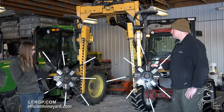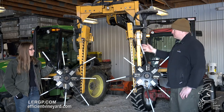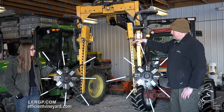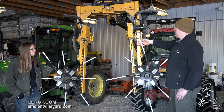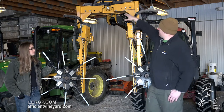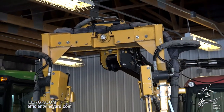So can you take us through the architecture of this machine, what it does and how it was designed? This machine here is a V-Mac tool arm with the Oxbow type head from when Oxbow was manufacturing and producing the tool arm and the heads. This is an offshoot of what was the Friday machine in Michigan and the Joy Laporte pruner here in New York. You have a comber style system with cutter bars behind — some have a top cutter, but most just have two vertical cutters. Also, the pruner has a pivot point; the head swivels side to side. So if you have a leaning row or a terrace vineyard, you have the ability to make sure that head is perfectly lined up on the row as you're pruning.